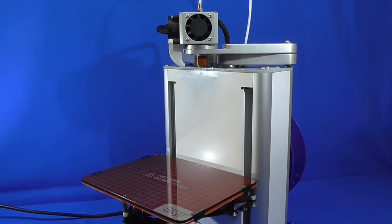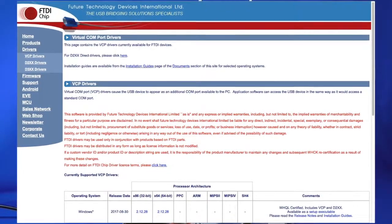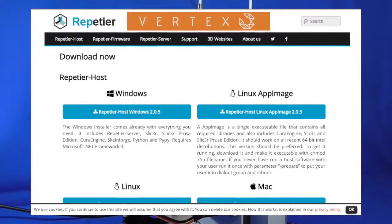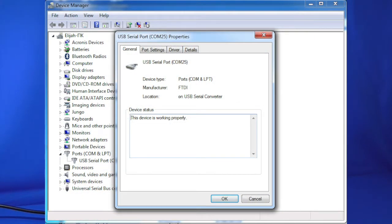Next, we have to install all the needed software. Connect SkyOne to the computer and to the power supply. FTDI drivers should then be automatically installed by your computer. If that doesn't happen, please find a link to the needed drivers in the description of this video. As SkyOne was tested to work with Repetier Host software, it is recommended to install Repetier Host. Please make sure the printer is connected and check that FTDI drivers have been successfully installed, with a valid COM port addressed to the printer.